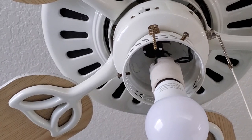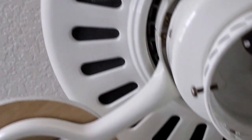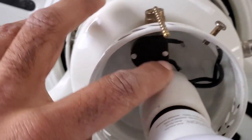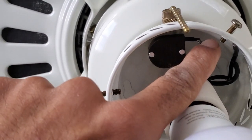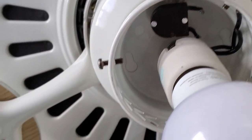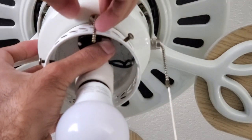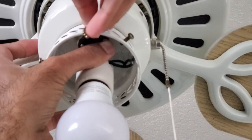If you're wondering why the wires were bare before I cut them just now, that's because I had already cut them before turning the camera on. But for the sake of being thorough, I decided to demo the process again. With the wires cut, all you have to do is unscrew the brass nut and the switch should wiggle right out.